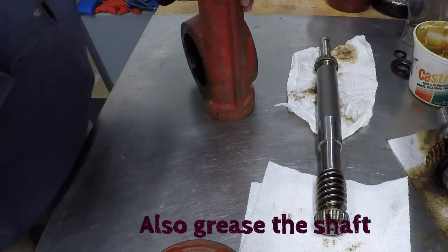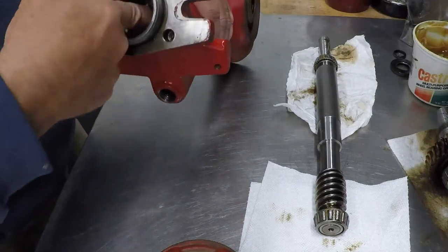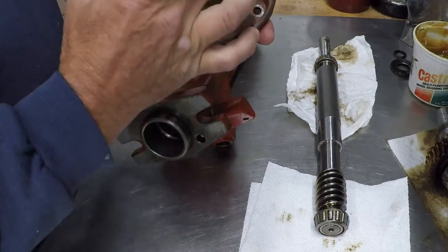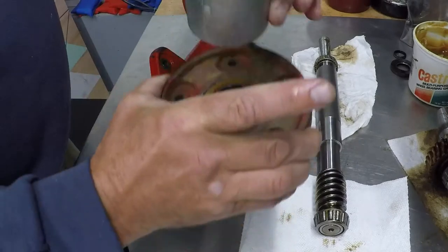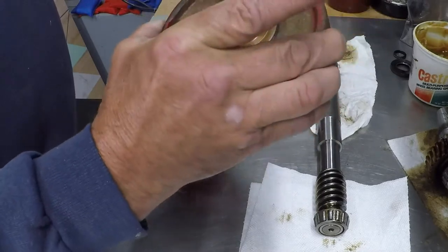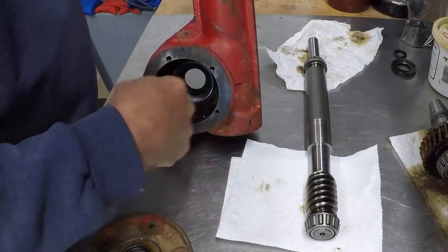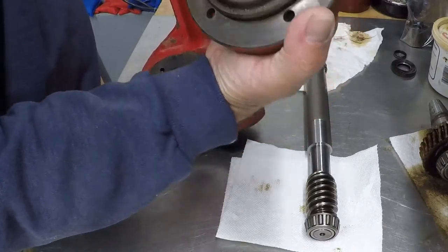When I installed this seal I used an arbor press. For these other guys I didn't have quite the right sleeve, so what I did was I heated up the cast iron just a little bit to expand it, then used an inch-and-a-half rigid coupling and worked it around with a plastic hammer, banging it down until it seated flush with the casting. I left the race in there because it was fine — I inspected it, the bearings are okay, they've been cleaned up.